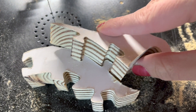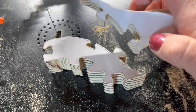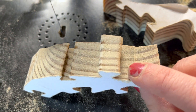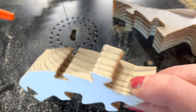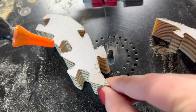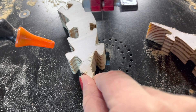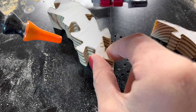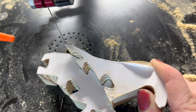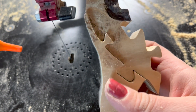It's down to the last piece and it has bevels because it will not go through the back side. A way I try to fix this is figuring out where the bevel happened — typically it'll happen around a big turn if you cut it too fast or if your blade is getting dull, which mine was. Because of the density of the wood and the size of blade I'm using, these corners are tending to bevel. So what I'm gonna do is take this piece back to the saw, run it close to the blade, and let the blade shave off that extra at the bottom around the corners where it got bigger. I'll do this until it fits — you can tell by sticking it back in where exactly the bevel is catching on the back.